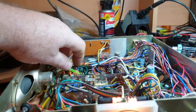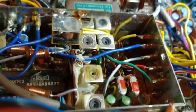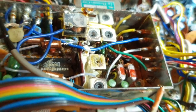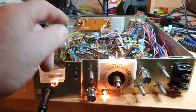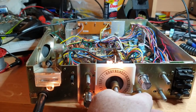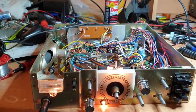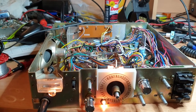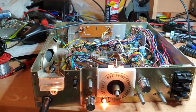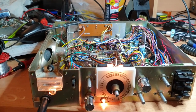Be very careful when pulling these out — you can easily break the little pots. So that's a quick session on how to save pulling a whole board out and fix an oscillator. If I had a dollar for every trimmer I've seen go faulty on these units — the biggest sign is that the oscillator just doesn't adjust. It's working, but it's three kc's off or two kc's off and you can't get it to swing. Go looking at the trimmer every time.